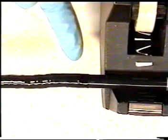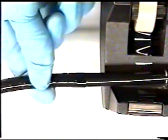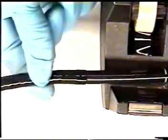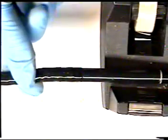Depending on manufacturer specifications, glue may take some time to set up. You will periodically have to go back to check your glue in order to turn the instrument if glue is sagging on one side, and to check for any bubbles or foreign debris that might stick out through our glue joints. Again, be sure to check your glue to see if it starts to sag. It will be necessary to turn the instrument around in order to make a uniform glue joint.